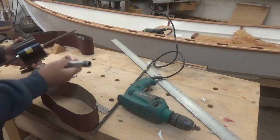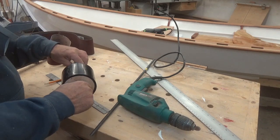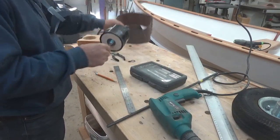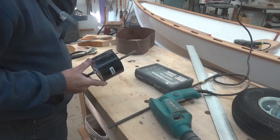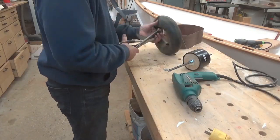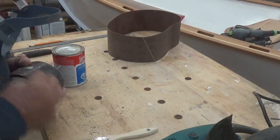Now for the handle - I've got a piece of pipe fitting here with threads that fits over the end. The idea is that I would be able to hold the drill with this spinning inside. I'll probably need to buy some more washers so this doesn't slide off. I don't need the threads so I'm going to cut those off. Now I've got my belt inside out, and for the belt not to just slide on there, I need to put something kind of sticky and soft - for that, I'm going to use a piece of inner tube tire glued on. I'm just going to scuff the PVC up a bit to give some tooth for the contact cement to stick to and clean off any grease.